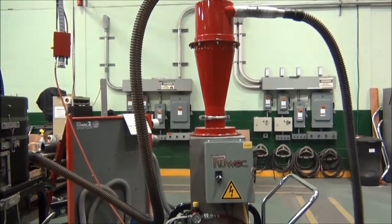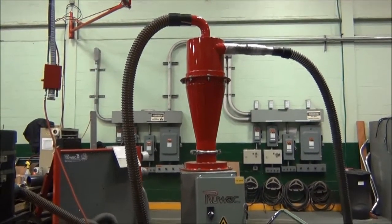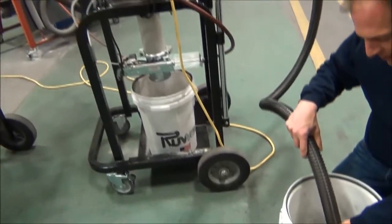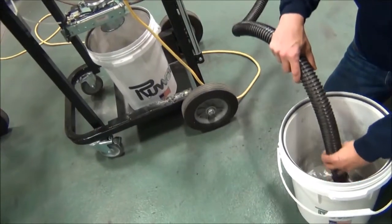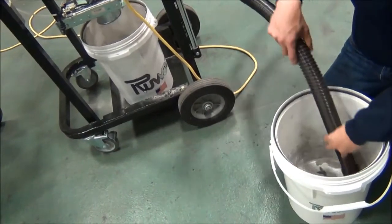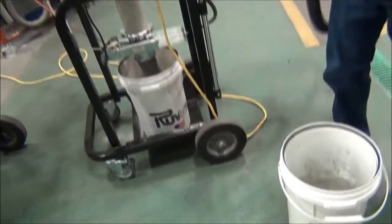Any of the ultra-fine smoke — that's your explosive dust, your real dangerous dust — is going to continue on into the immersion separator, and that's going to protect the operators from any hazards of the collected dust. So the two pieces go hand in hand together for the additive manufacturing world, forming an extremely safe system.